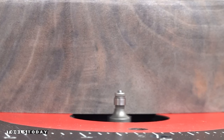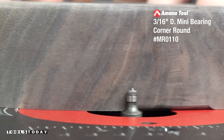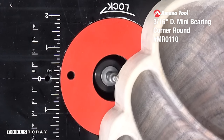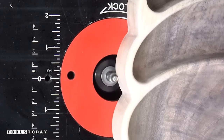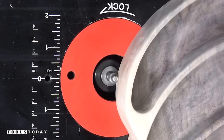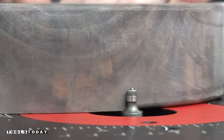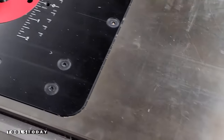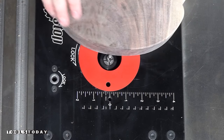Then I'll get the bottom of the tray rounded over using the MR0110 3/32-inch radius miniature round over bit. This has a 3/16-inch diameter ball bearing on it, and it can get into all of those smaller areas. Most round over bits have a much larger bearing that definitely does not fit in those areas. This gives a nice profile to match the top of the board and a really nice look to the bottom. The SawStop router table is amazing — there's absolutely no dust left on here.